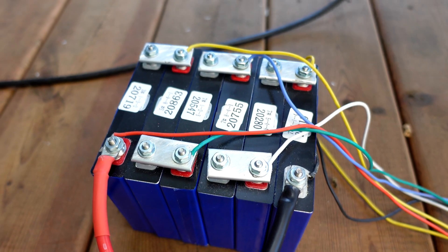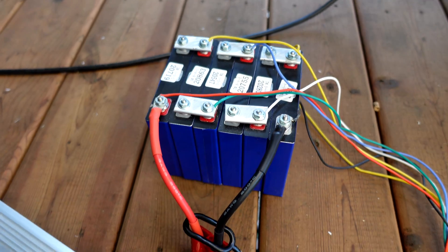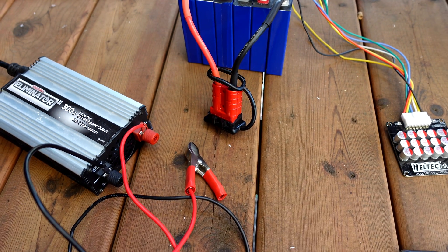The cell I built is 20 amp hours, so that means I would have 10 hours of continuous runtime. But the initial startup probably eats off an hour or two, so I think you could comfortably run eight hours with this setup without a problem. If you're looking at building the battery yourself, I'll link to whatever you need for parts down below.